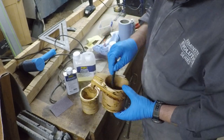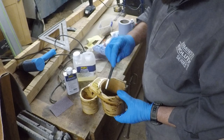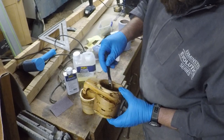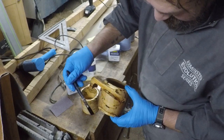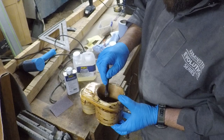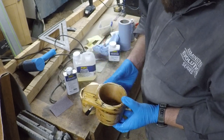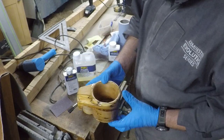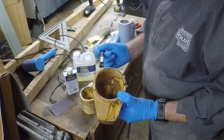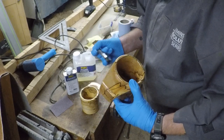I have turned cups in the past, more of a traditional style kuksa shaped cup rather than a mug. And I've actually cut the handle spigot and processed it all up on the bandsaw. And then I've turned it with the handle on. The only downside is obviously, you can appreciate, it puts a hell of a lot of stress on the bearings of the lathe with that peg just spinning around unbalanced. It makes life difficult for actually physically turning it, because there's so much vibration and chatter and everything's running out of true, it's fighting against you.